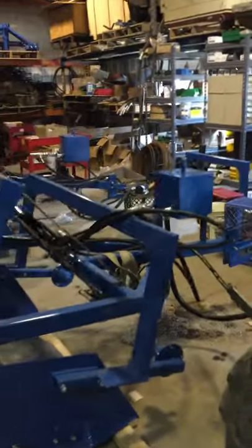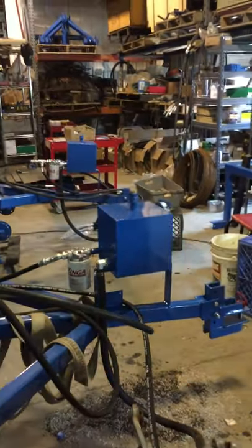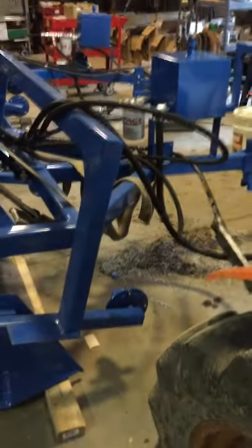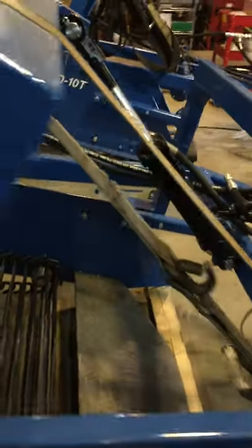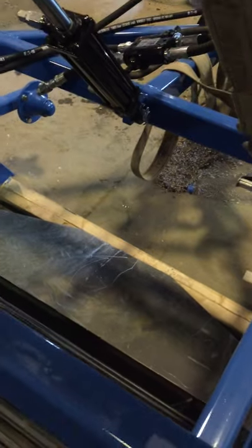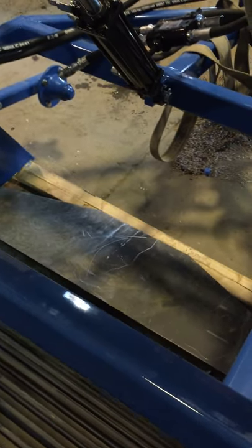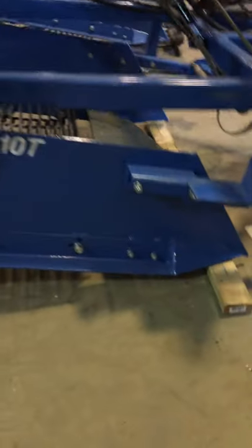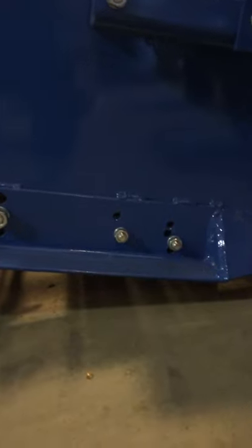Here's the front end where it hooks to the tractor. All of the things we run will be running off of that hydraulic system with this tractor at an idle. This will have coulters mounted on right there, and then we've got a sweet potato blade that digs a little deeper in the middle of the front. This machine will also go with a straight blade in case that's what's appropriate. These machines have an adjustable blade and an adjustable front roller so you can get the relationship right.